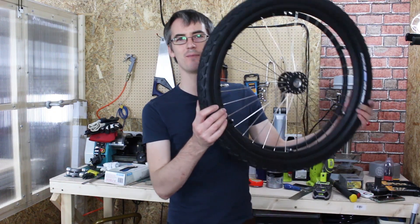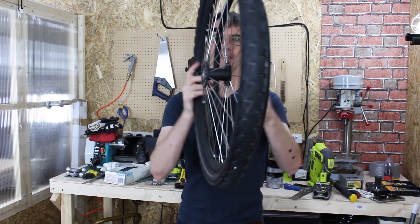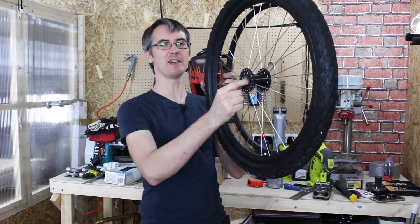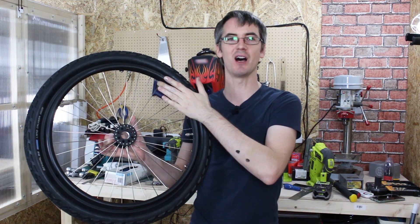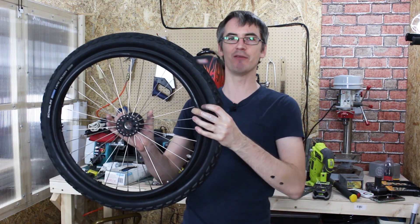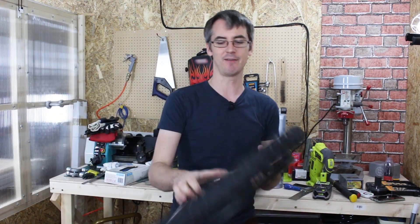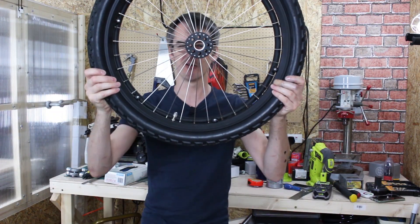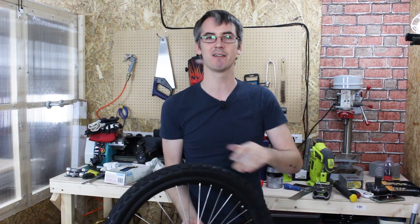So we're making a car, but what wheels are we gonna put on it? Well, Beetle wheels are pretty big — they're about two foot in diameter. So I found these wheelchair wheels. They're designed to be supported from one side, they've got this handy rail on the outside where you push yourself along, which we're gonna use to put the hubcap on. These are super heavy-duty off-road ones, so hopefully they're strong enough to support the whole thing. I've knocked the bearings out already, which did have a 12mm bore, and now we've got about a 25mm hole that I can put a bigger axle in.